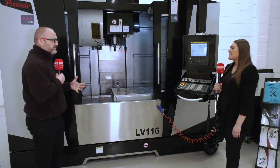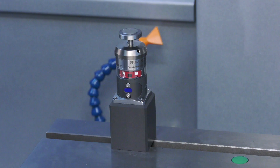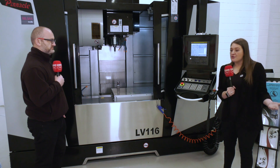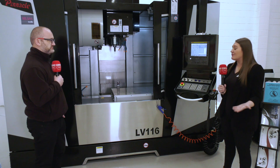How does it interact with the control? Let's say it's a 10mm tool and it does drop out of tolerance — what's that journey? How does it communicate with the control? You can use a probing cycle within your programme. Halfway through your programme, you can call up a cycle. When you're getting the machine tool ready, just checking tools — maybe another person has used the tool before — just to make sure it is the right length and right radius.